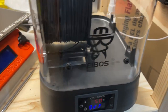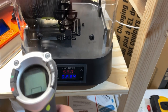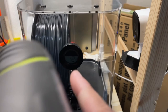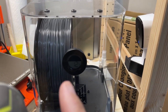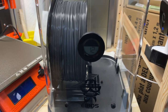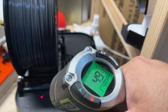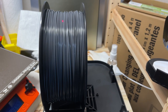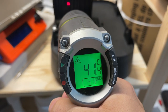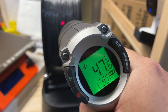Other than that, I'm going to get my temperature gun and check some temperatures inside the housing and on the spool of filament — to see if there's a temperature difference between the bottom, front, back, and the top. I turned the machine off. We're at 49 degrees on the bottom, 41 on the top, 41 on the side, and 47 on another part.